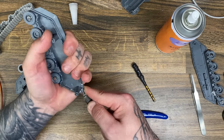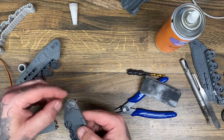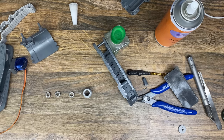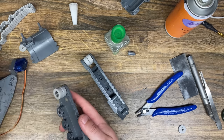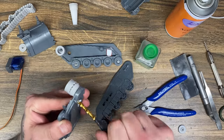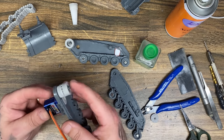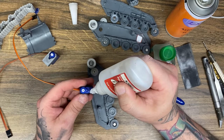Adding the axle for the front section was not easy — I had to cut off the original nub and stick in my own so I could mount my own hub on top. I also designed and 3D printed what I think should be called a sprocket — the thing that drives the treads. I don't know the fancy words for building tanks because I don't build tanks for a living. What I ended up doing was making the same gear-driving system as I did on the flamer tank, with one gear driving the gear that drives the treads.